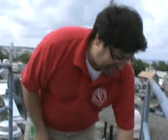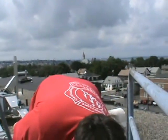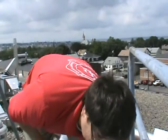For example, here, if you can show. We have a bridge connection between this piece right here and this piece right here. And in other locations you can see that as well, where bolts have been used to connect the bridge, and then on the other side they just rely on the weld. These welds will eventually absorb moisture and they will rot from the inside out. So it's necessary as well to put a bolt here and a bolt there and the other side as well, not just rely on the weld.